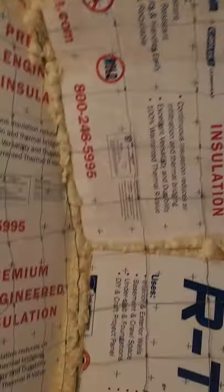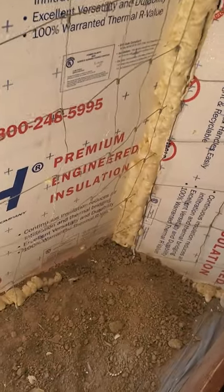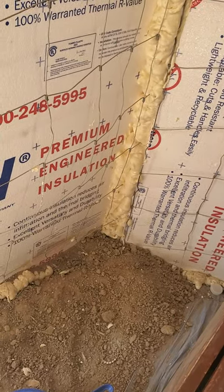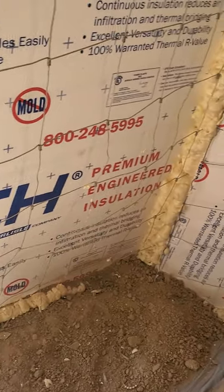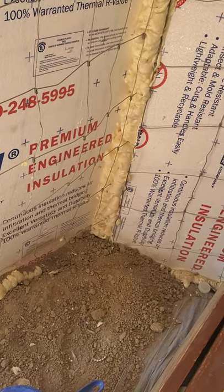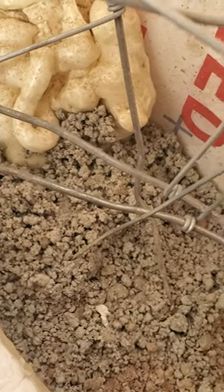The next step: I think I'm going to seal off the ground today. I got some free bags of cement that I'm mixing with perlite and putting on the floor. I'm doing one part hydraulic cement — and I'll show you over here where I've done it already, in the bed — one part hydraulic cement to four parts perlite.